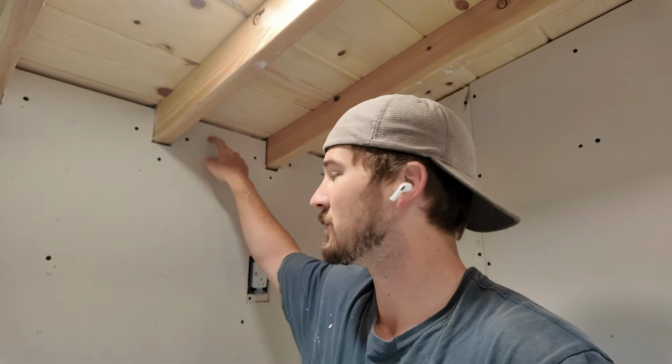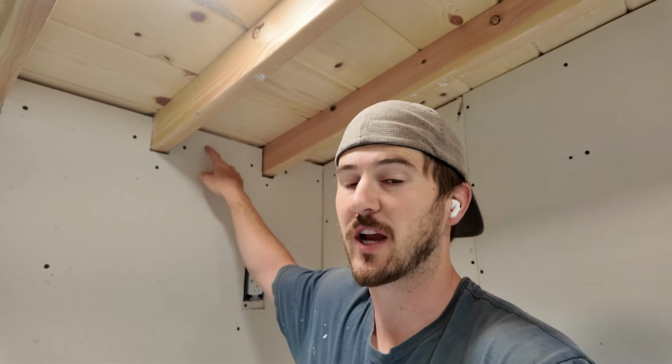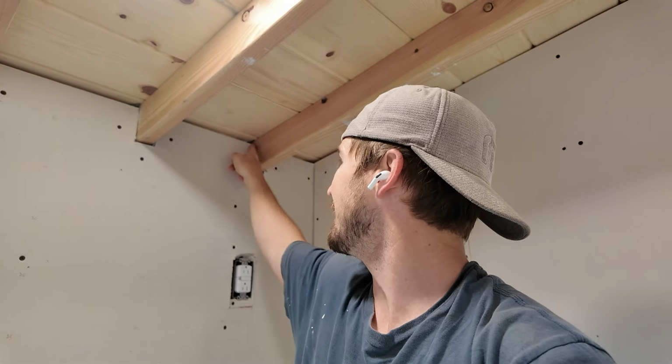And the reason that it's been on my mind is drywall can absorb moisture, but I think for the most part, it doesn't expand nearly as much as the wood that it might touch. So this gap is gonna have different amounts of movement involved with it. My initial thought was just to use something like big stretch caulk that could just span that gap. To be totally honest, that still might be a good viable solution. And I think that's what I plan to do with these gaps.